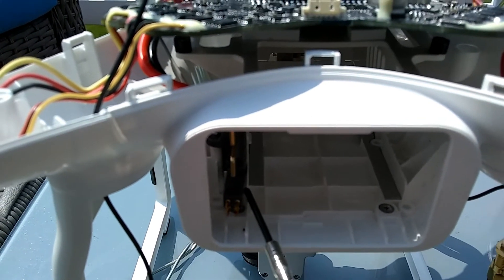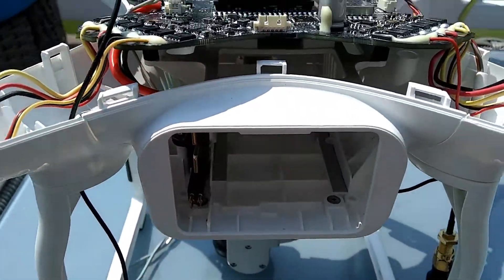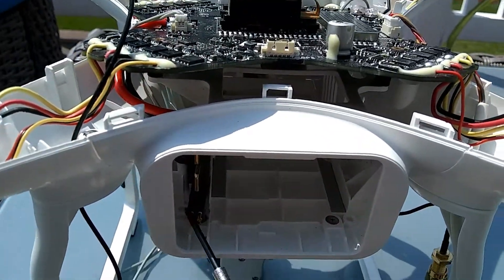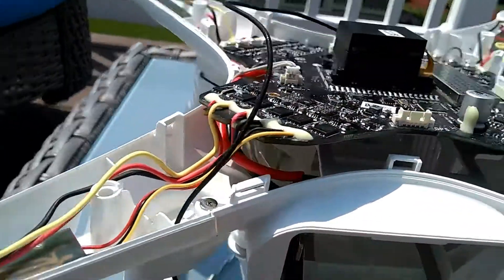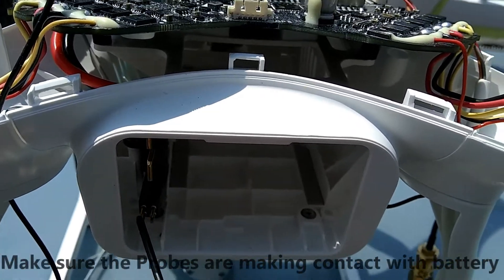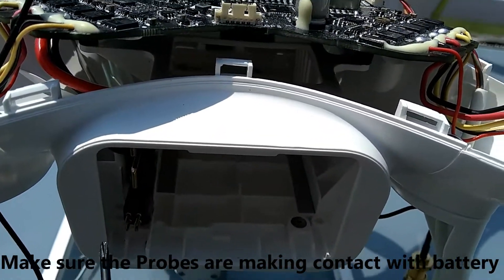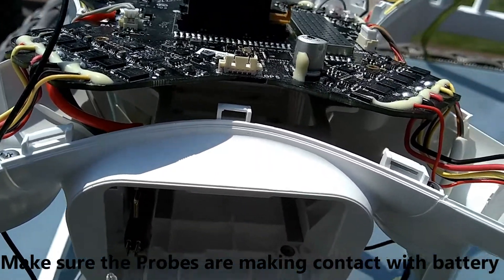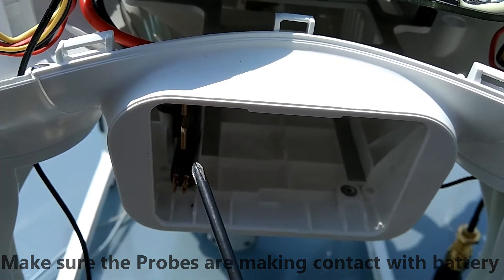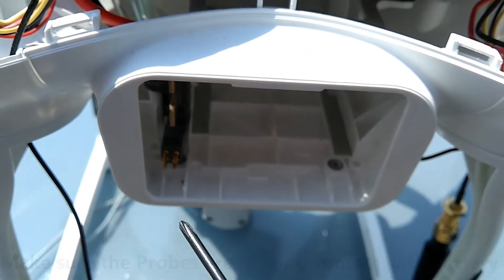The battery clicks to the arm connectors weren't lined up. I took the connectors out and plugged it straight into the battery. As I was plugging it in, I noticed that the bottom probes that transmit the telemetry right here weren't touching. So that was the fix — I lined it up, took it back out, put it in, and now the battery shows up. I was getting the error message before saying I wasn't receiving any battery voltage.